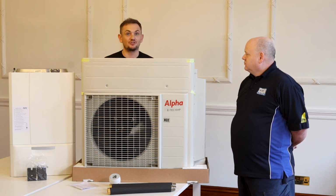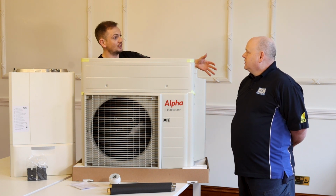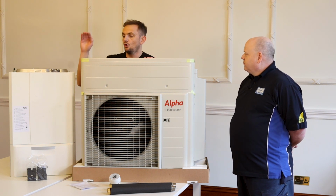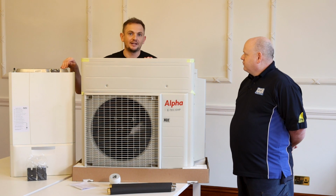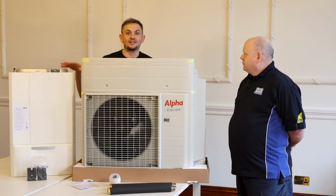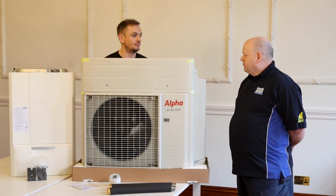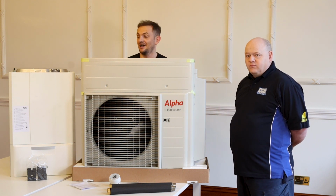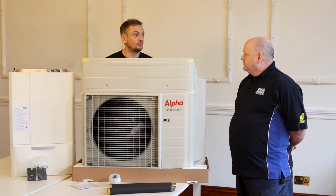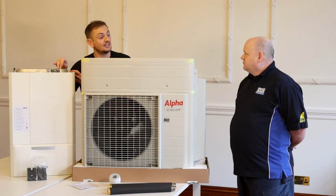So to do that with a normal air source heat pump, you have to have an internal water tank like you've got in your garage. Yeah. With a buffer unit and all the rest of it that comes with it. All your hot water production is still going to get done by your gas combi boiler. So you're not going to save any money on hot water production, because that's still being done by the boiler. You can reduce it by using less water, and also you may get a saving because if your existing boiler is only 60-70% efficient, this is 93, I think, rated.